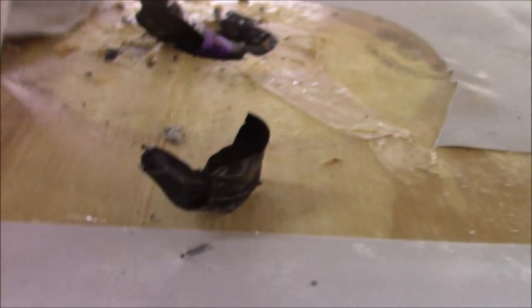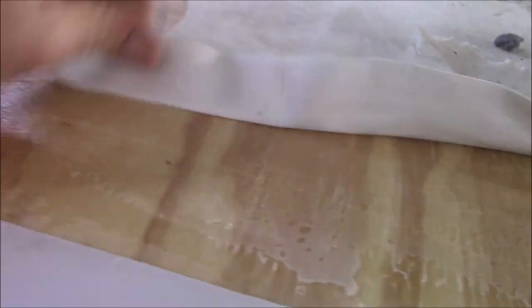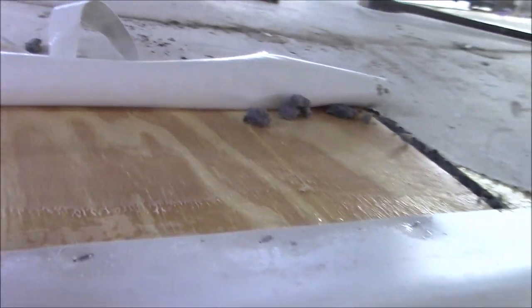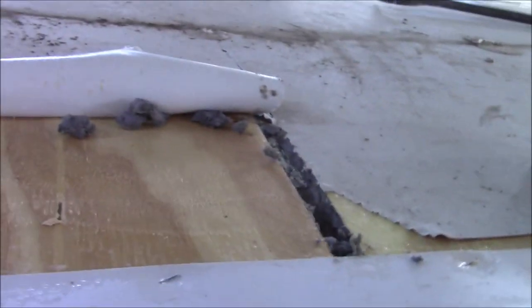I usually get these things in kits and they come up real easy. So this is supposed to be their brand of TPO. That's what it is, but it's real thin. You see I got some edges that look like they're a little heavier, but it doesn't take much to pull this up. You wouldn't be able to do this with a roof like ours. It won't come up once I get them down. That's why we're so particular in the way they go down, because if you get a bubble in it and you have to take it up, it doesn't want to come up. It is a lot of work.